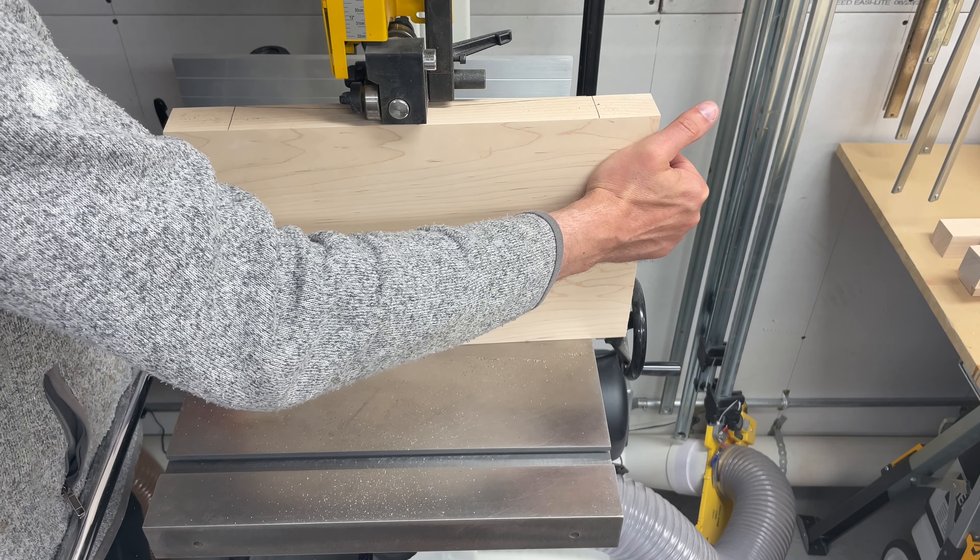A couple lessons I learned here. The instructions pretty clearly state that the quality of the tenon you get is completely dependent on your ability to hold the drill straight and level. My ability to do so was so-so — my tenons were decent but one of them ended up fairly off center. Luckily I had made five legs so I was able to keep pressing forward. I put a link in the description to a cutter similar to the one I bought. I don't think this style leg suits every furniture design but it's a pretty cool option to have.